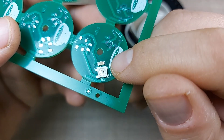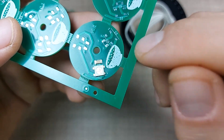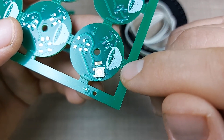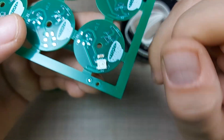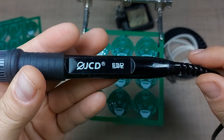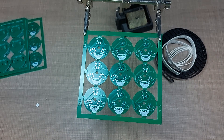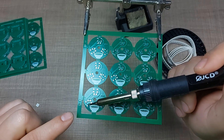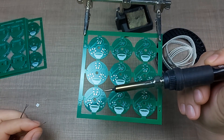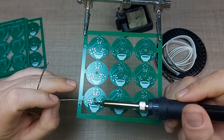Now the plan is that I try to solder some of these boards and see if they work, or if we made a mistake. Bear with me — this is my first time soldering SMD components on a board like this. Right now I don't have solder paste to do it with the hot air gun; I'm still waiting on that to arrive, so I'll use a regular soldering iron with a small tip. The plan is to first add a bit of solder to one of the pads, place the component, tack it in place, then solder the other lead. Here goes nothing.